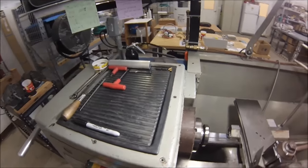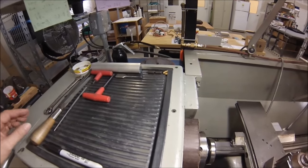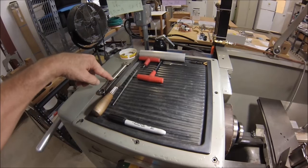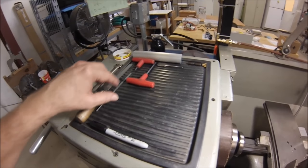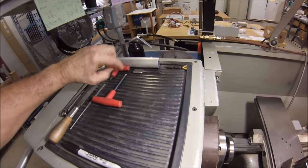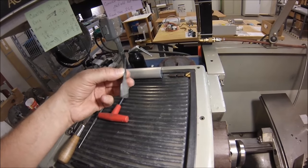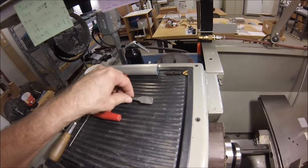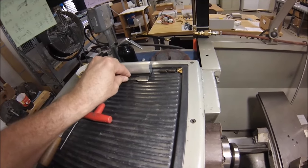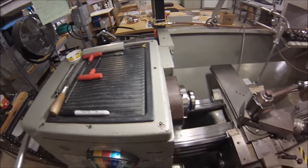The top of my machine is never very cluttered. I have a small cup for worn-out inserts, a wrench for tool post height adjustment, two different files, one key for the tool holders, one key for the parting tools, and that little tool for when the dastardly nut spins on the Aloris holders and jams it up. Plus a Sharpie marker — that's about it.